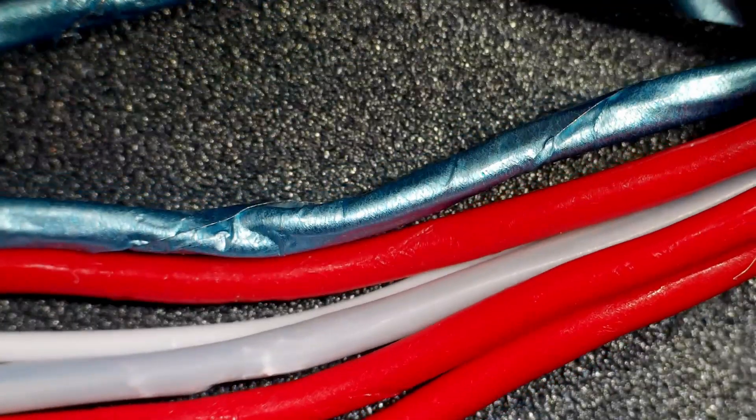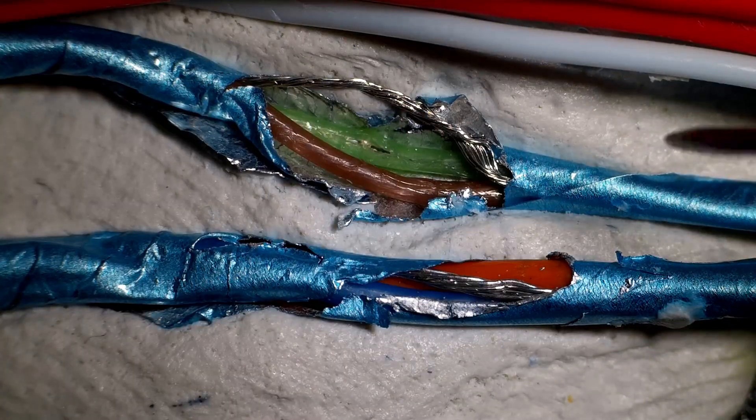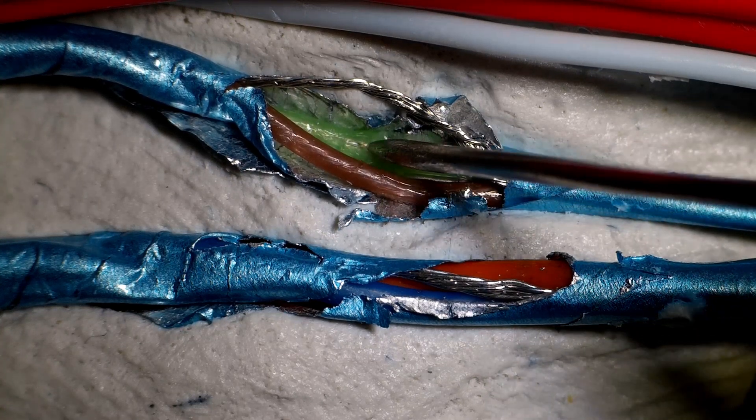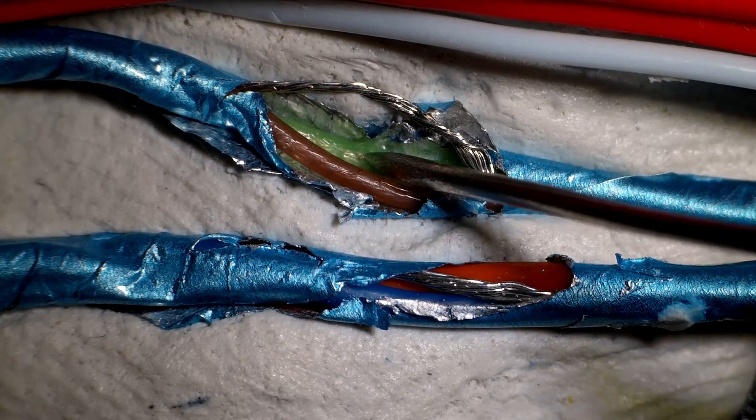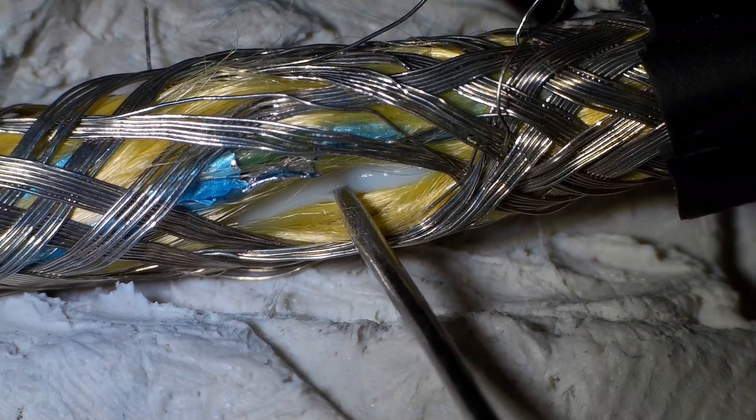These tiny wires don't want to stay still enough under the microscope for me to be able to cut into them, so my friend here is some blue tack — or in this case, white tack. Cutting open the grey sleeve does indeed expose yet more wires. They look very thin and fiddly, and there's a bit of damage to one of the strands — I expect I did that cutting it open. I'll come back to these later. These red wires are positively chunky in comparison, and the shielded bundles turn out to be twisted pairs with a ground wire. I take my time testing between the various wire cores and the pins on the headset connector, adding the wire colours to my diagram. I then expose the wires near the combiner section and test the continuity through the long cable length — everything seems fine so far.